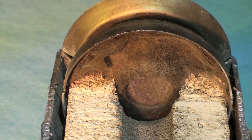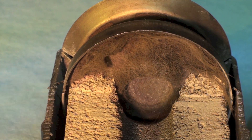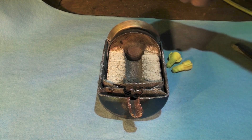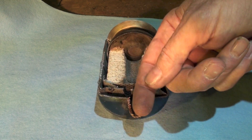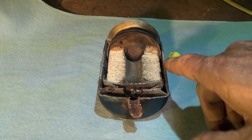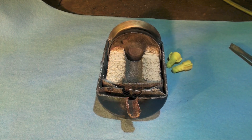There's a little piece of fiberglass insulation here that acts as a kind of filtered gasket, and it also keeps the desiccant block from breaking too easily. If you drop these solid core dryers you can break the desiccant block and end up with a busted dryer. We like to shake these dryers before you put them in just to make sure. So when refrigerant's coming in this way it goes through the outside to the center and out this way. When it's coming in the other way it does exactly the same thing because the valves are all reversed — it goes out here to the outside, through to the inside, and out that screen right there. That is the heat pump reversible dryer.